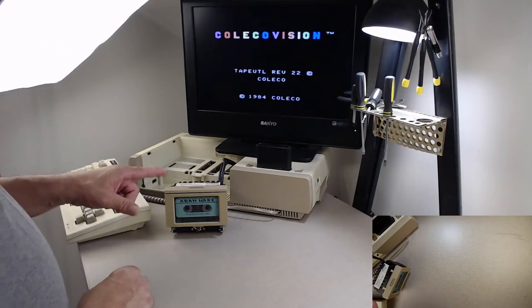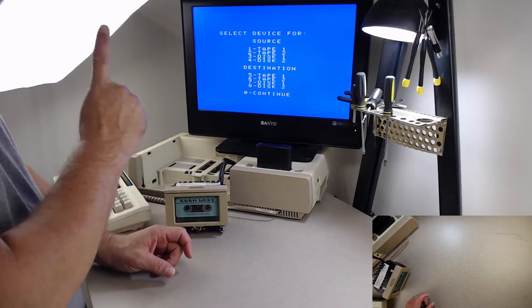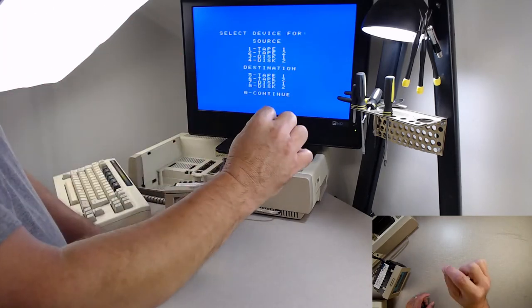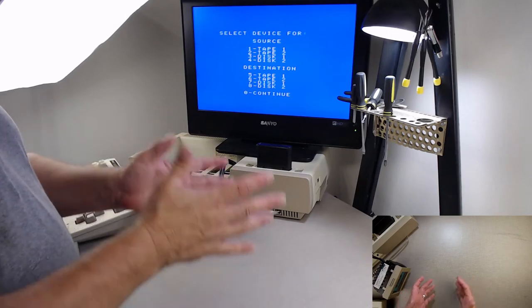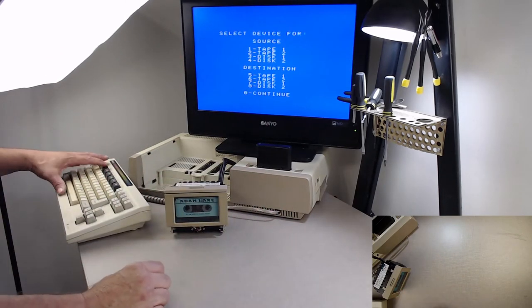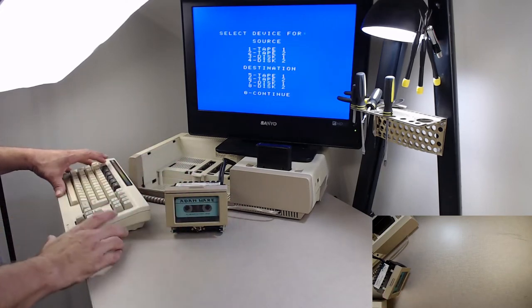Now when it comes up, I'm going to use this utility because I want to verify I can read and write from the first track, which is block 0 through 127, and read from the second track, the one in the back, which is blocks 128 through 255. If I can read and write and verify those two tracks, then the drive is good. It may overheat or stop working if you run it for hours, but it's good at that point.